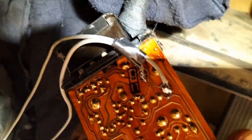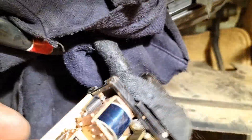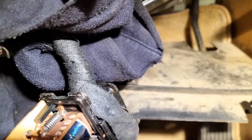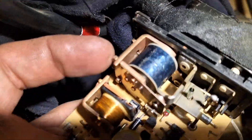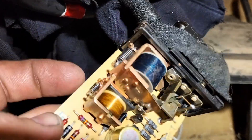What I've done is I have soldered on another switch. Bear in mind that all the current does not go through this relay over here. All I have done is to bridge this relay — this yellow one — with a switch over here in the dash.